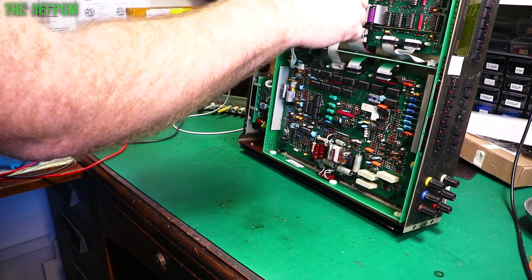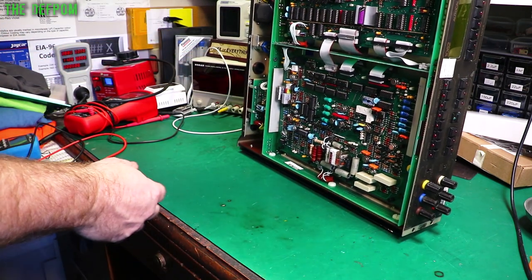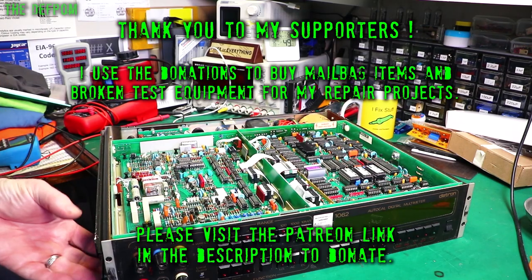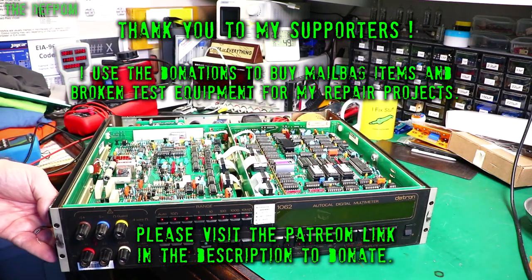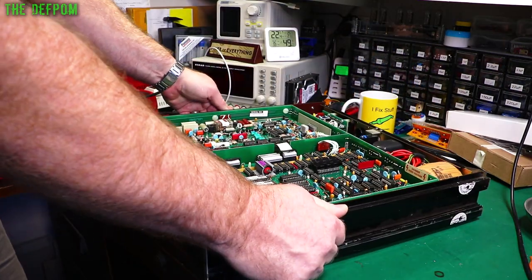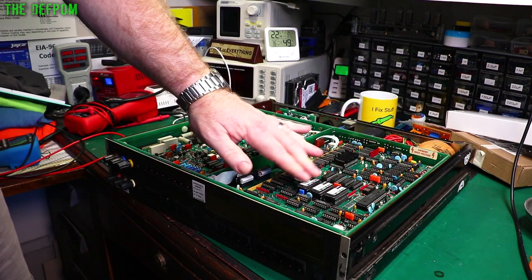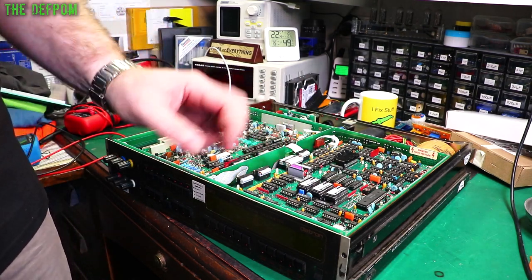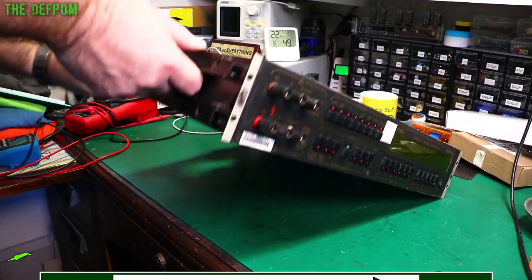The other chips are 29005657 and 290113A. Interestingly, these chips are stacked — they've got extra sockets offset off the board. The original sockets are there and another socket has been put on top of them. It doesn't appear to be a 2732/2532 adapter situation since they're going straight through. Maybe those sockets were dodgy at some point and someone just put new sockets on top of the old ones.